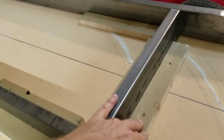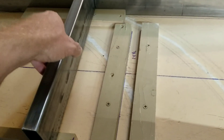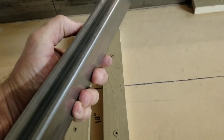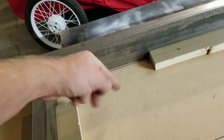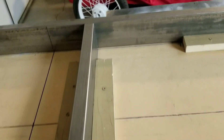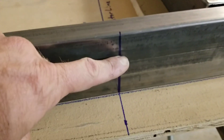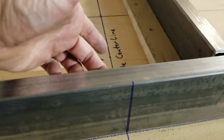On the frame jig I did a little bit more since last time. I went ahead and got my front cross member done — put framing on both sides, and this happened to be 14 and a half inches wide. Before I put this in I indexed them, drew on the board where it needed to go so it's nice and straight and square. Same thing with the back cross member — we notated where it goes; it's 18 inches long. There's a little one-by-two to locate it. Keep the weld joint on the bottom. I also marked out where my axle centerline is going to be on the frame rail. The next step is to find the center, drill through both sides with a drill bit, then hole saw the outer side and a smaller one on the inside. We'll do that right now.